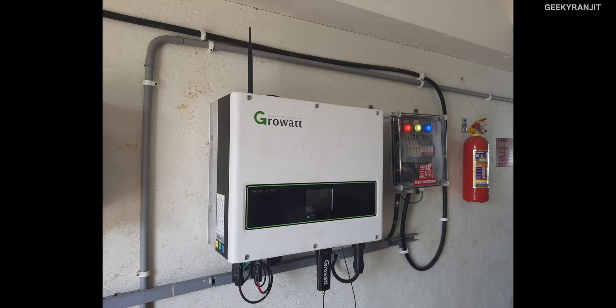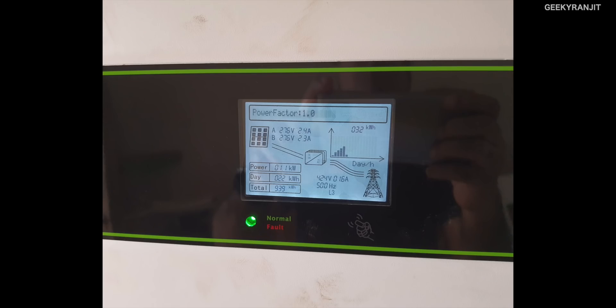Can the entire house run on this? Yes — with an on-grid system you don't have to worry, because if the solar panels aren't producing enough power, the system automatically pulls that power from the electricity grid. For off-grid systems with batteries, typical battery life is about 5 years. Lithium-ion batteries can last 10 to 12 years but are currently very expensive and not commonly used in residential setups. Solar panels themselves last about 25 years, and the inverter is warranted for around five years. The new inverters are internet-connected — we have a smartphone app that shows real-time generation data for our 5 kVA on-grid system.